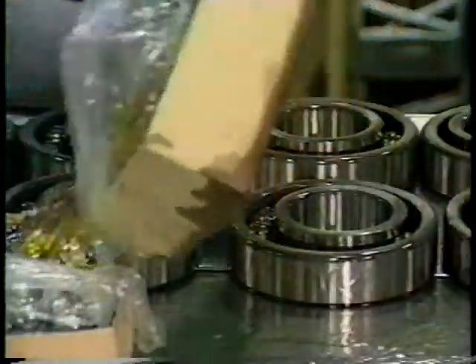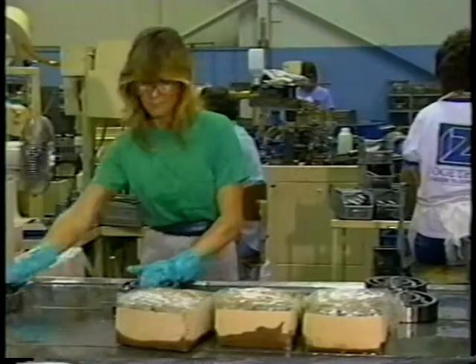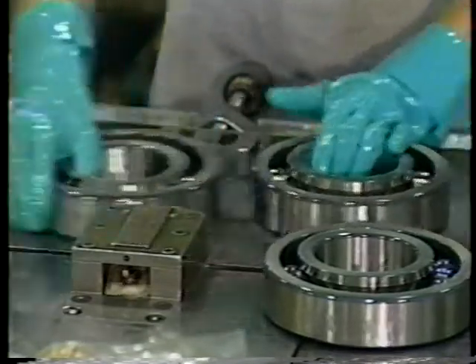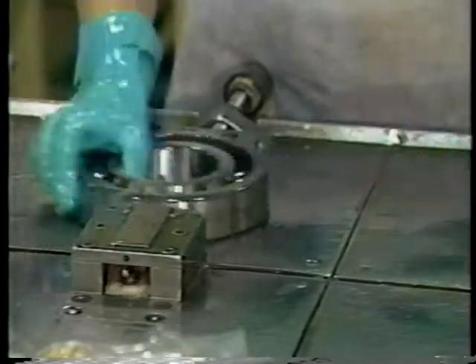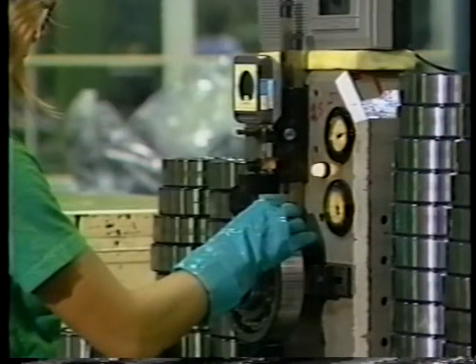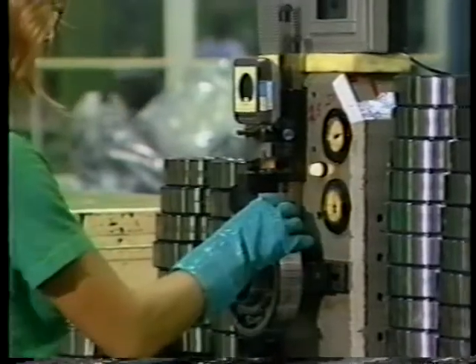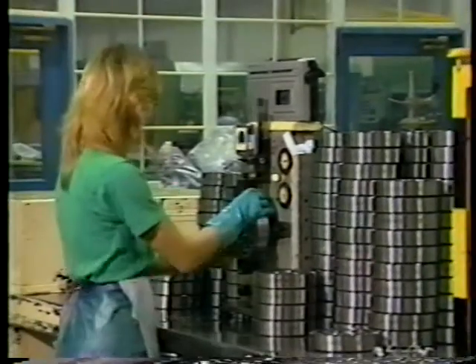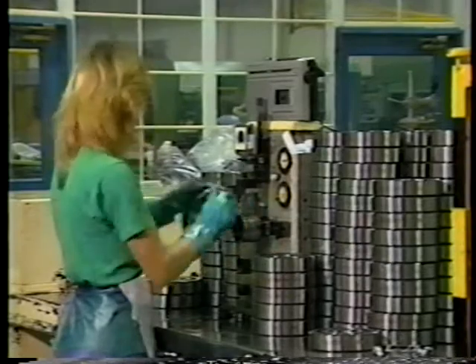The proper ball is now filled or assembled into the inner and outer rings and set manually. The outer ring must now be deformed so that the balls can be placed between the inner and outer ring in the bearing assembly. Next, the bearings go through another washing operation and are checked for radial clearance, to ensure that all of the preceding operations were correct and that the bearing has the proper radial clearance.